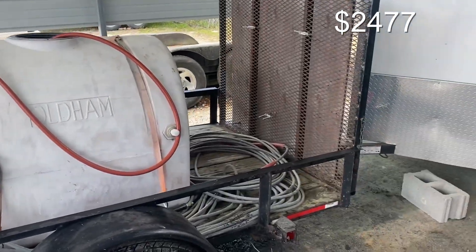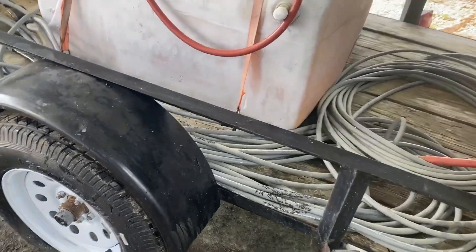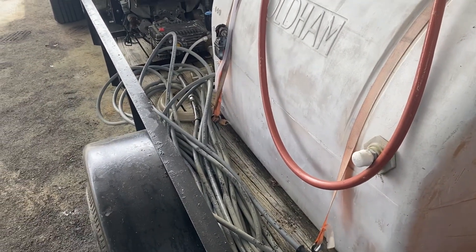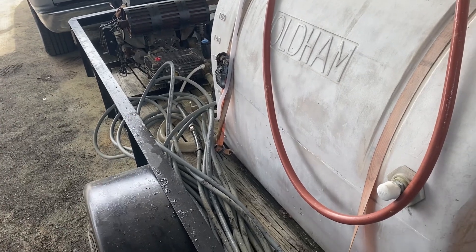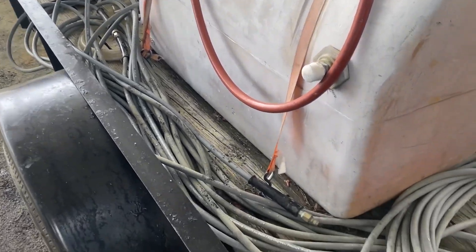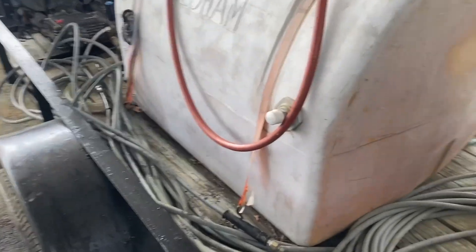You might be saying, where are your hose reels? Hose reels can get pretty expensive, and in all honesty, if you're just starting out, don't buy hose reels. For many years, we just did the old figure eight, which actually prolongs the life of your high-pressure hoses because there are metal wires in there. When you put them on a hose reel, it's a very tight diameter, and that can actually lead to premature wear of the wires within the hose, which will eventually burst. That's why we do the figure eight — you just pull it out and go to work.